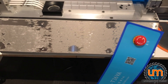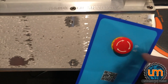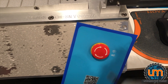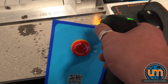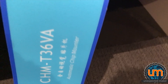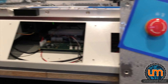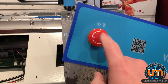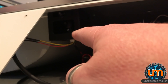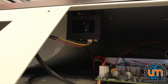I've got it off — it's as far as I'm willing to go at the moment. The surface is still sticky; I might even be able to get it back on again, although I doubt it. I don't want to cut it to get it off here yet. Potentially I could disconnect the button from the inside once it's open, so let's get it open. The panel's off — it's just sitting here. I didn't disconnect the emergency stop button so it's really hard to see inside, but that's it in there and there are some screws in there that I need to adjust to do the focus.